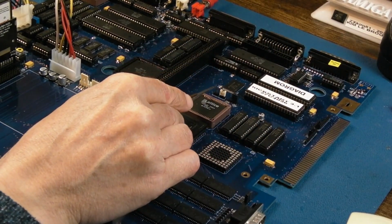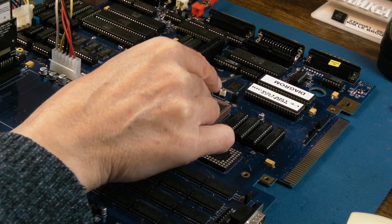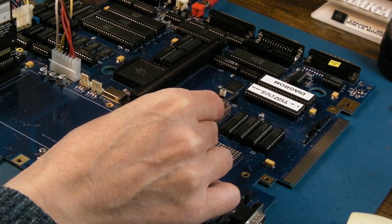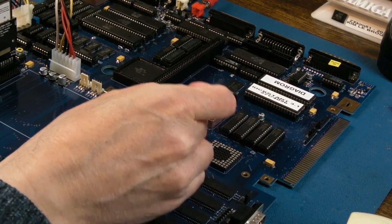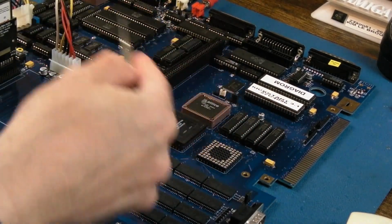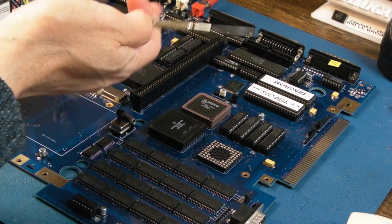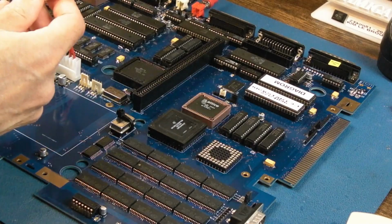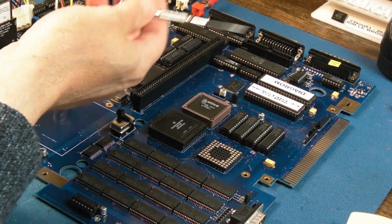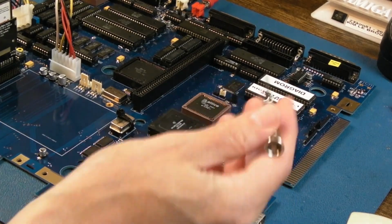I think one of these jumpers enables it to flash the flash ROM there. The other one is when you actually use it. And it boots, I think, before your main kickstart, does something with the RAM, puts it in the 32-bit range or something like that. Now, in order for it to be detected, I found that when I switch this over here, I get no RAM. It's because I've got to do addmem, and you've got to give it, obviously, the range where you want to stick it, where it's sat.